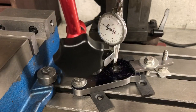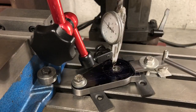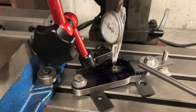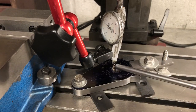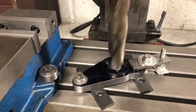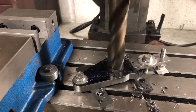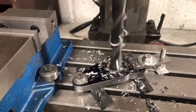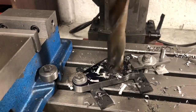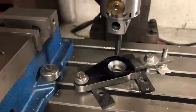I have clamped the part down to the mill table, and using an indicator I have picked up the three-eighths hole that is in the centre of the bore I need to enlarge. I am up on a couple of parallels, just to put a bit of space between the component and the mill table, and I have locked off the table in both directions. I am going to open this out with a couple of drills before switching to the boring head. I may have been a little optimistic with the initial drill choice of fifteen-sixteenths. Progress is resumed by stepping down to eleven-sixteenths. And even after this, the mill still does not have the torque for the larger bit, so it is onto the boring head, taking roughly twenty-five thou off diameter per pass.